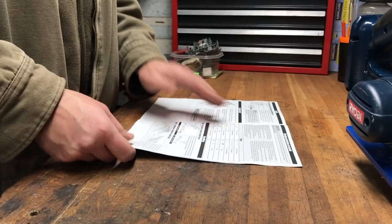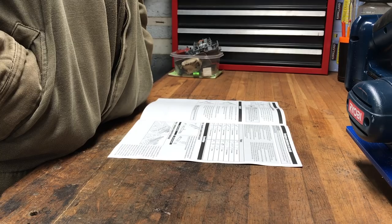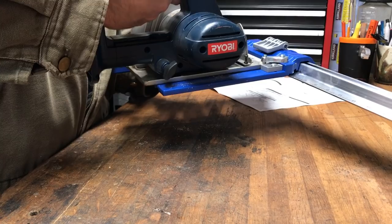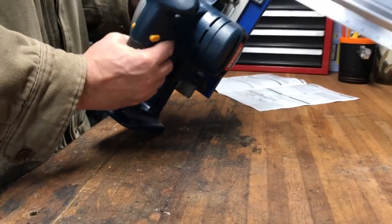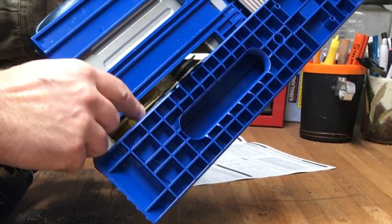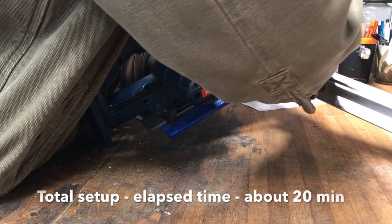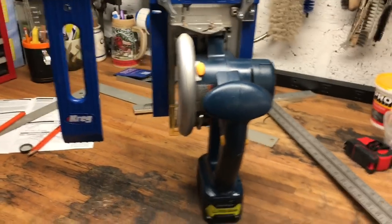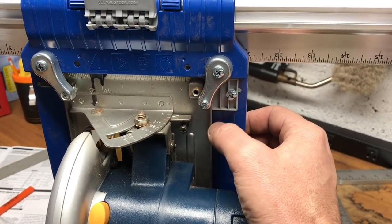Align the cursor to the narrowest cut. Rotate the saw blade guard up until the blade just touches the edge of the guide. Lock the sled in position by pressing down on the handle. You want this to roll up like that — and that is your cursor. So the saw blade is up against the fence. We're cutting along this line here, and they want you to align the cursor at the end of the fence, which is about where I got it. Pretty good. There's the index stop right there — that lines up with the edge of the shoe, the end of the fence.